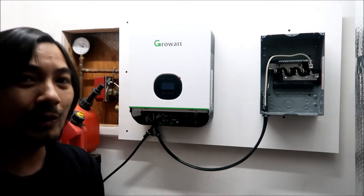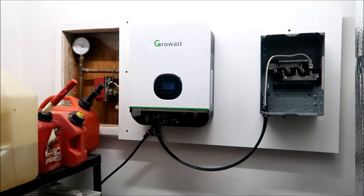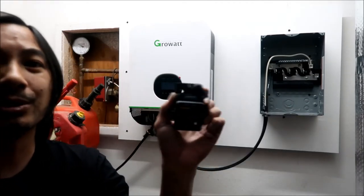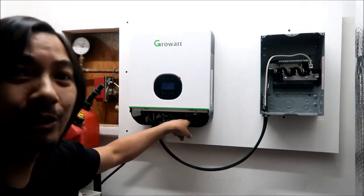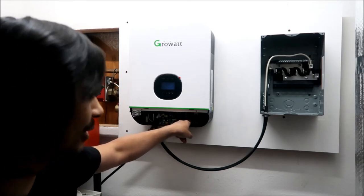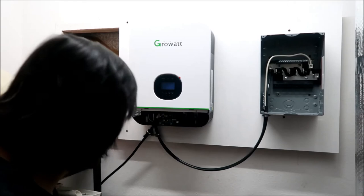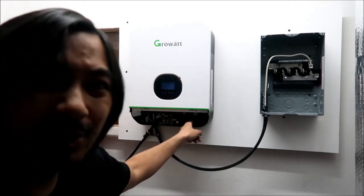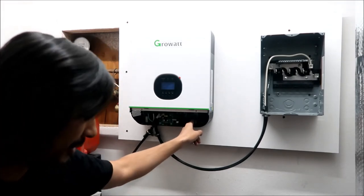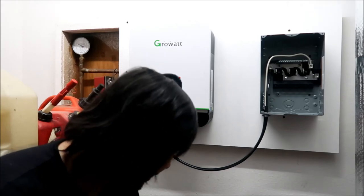So in the next video clip, we'll be installing the breakers and the fuses for the DC stuff. So we're gonna be installing the DC breaker. That means we're actually gonna be installing the thing on the terminal right here. This is gonna go between the battery and the inverter terminal. So we'll actually be using up the positive right here. I don't like how they label this stuff. It's really hard to figure out what's what. You have to really look at it. They have labels on it, but okay.